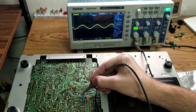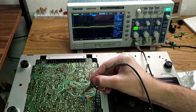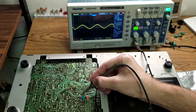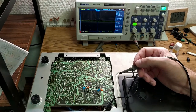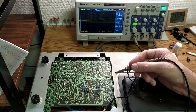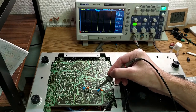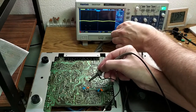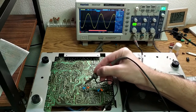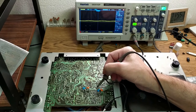I haven't actually fed a signal into this yet, and I haven't seen how it's recording on tape. What I'll do now is make them both the same — same on each side — and then hook up a source, try recording a tone, and see what happens. I've wired these in and put in a new 18 millihenry inductor. This one was looking pretty good — that's the attenuated signal, that's the original bias coming in. We should have the same here, and look at that — beautiful. Almost nothing on the filtered output on both sides. They're pretty close — a little bit of fine-tuning and they'll be basically the same.